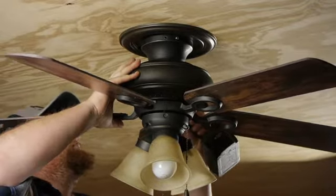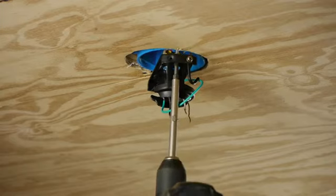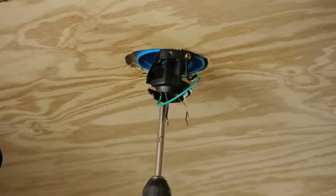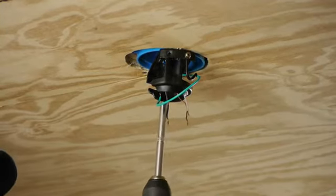When installing a ceiling fan, there's a couple things that you need to have. One is a good bracket to fasten the ceiling fan to. If you don't, it's going to sit there and wobble. Your chains are going to knock against your sconces — it's just so annoying.